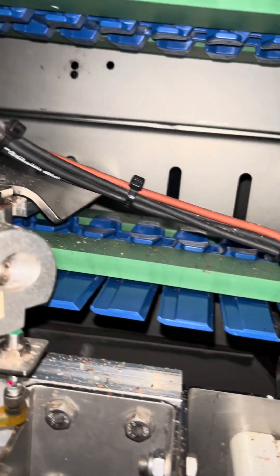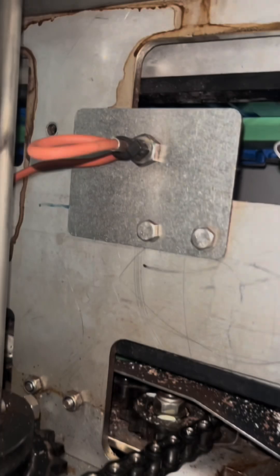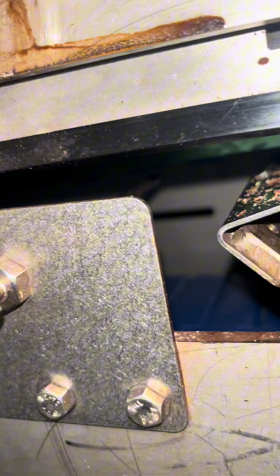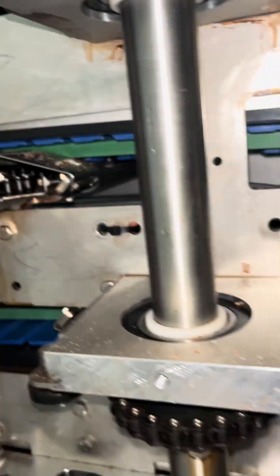As you can see, following the red cable up, that's going to be taking the air up to the PT100 and that's taking the ambient temperature of the chiller. So why would we use these transmitters? It isolates the components from having to do an extensive run if you get a faulty PT100 or thermocouple.